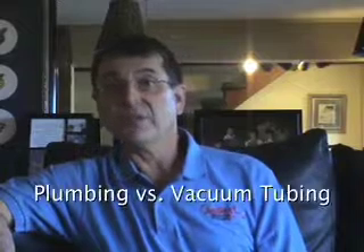We don't really care at Central Vacuum what kind of tubing you use — we just want to recommend the advantages and disadvantages of both. There are some advantages to plumbing pipe in that it's available just about everywhere. The only disadvantage is that it's slightly larger in diameter, making your drill holes a little bit larger. The main advantage of vacuum cleaner tubing is that it's thinner and lightweight, so it's easier to use in a retrofit job. We always recommend standard vacuum cleaner tubing for most retrofit jobs because it is thinner, lighter weight, and easier to use than Schedule 40 plumbing pipe.